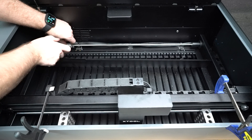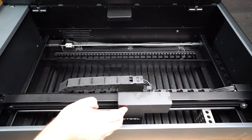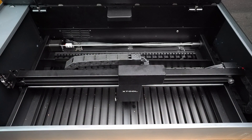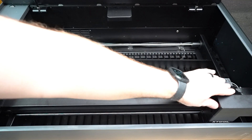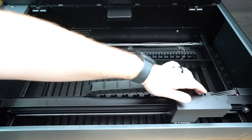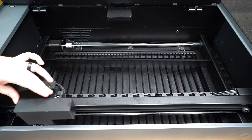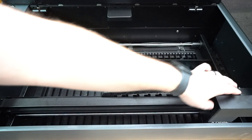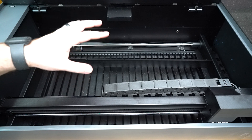It was very tight when I loosened it. Now we're going to undo the clamps, move them off to the side, move the gantry back a smidge, and take out the setup blocks. I'll link the ones I have in the description if you need a pair. They're nice to have for weird stuff like this. Now that we've done this, let's move the gantry from one side to the other. We do get a little gap in the center, but it closes back up on the left side. I think that plastic might just be bowed a little bit. We're going to button this back up and run our test files again to see if we get better results.